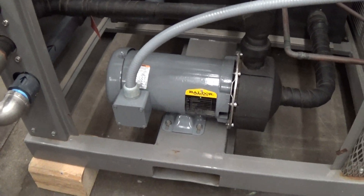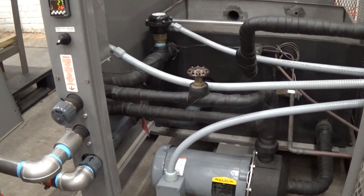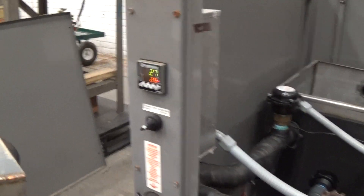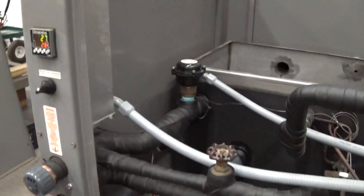The glycol pump always runs, of course. Getting back to the bypass and the flow — another way of saying it, you can just say we hit 27 for the compressor shut off.